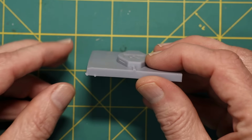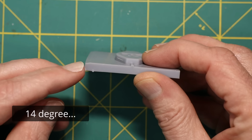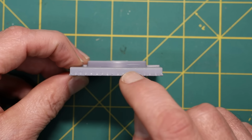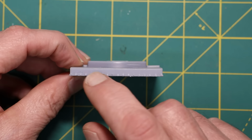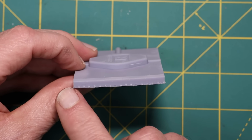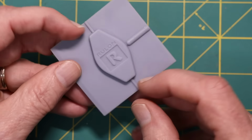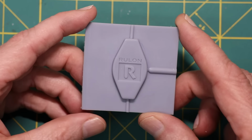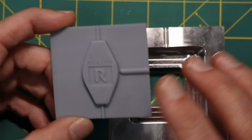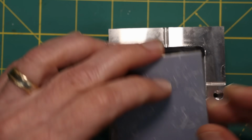So what I did is I added a 45 degree chamfer, as you can see there. And the idea of that is that even though there might be some warpage near the bottom of the chamfer, at the top it would be perfectly flat. And that turned out to work out quite nicely. I put some heavy supports here to try to minimize the warp, but as you can see, I still got a little bit of warp. And again, it won't make a difference. It'll work just fine. So this is going to go on the bottom of this, and it is oriented like so.